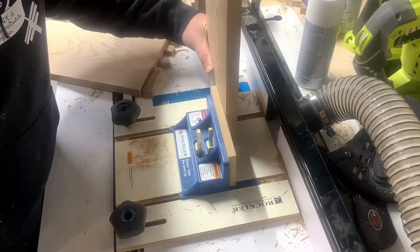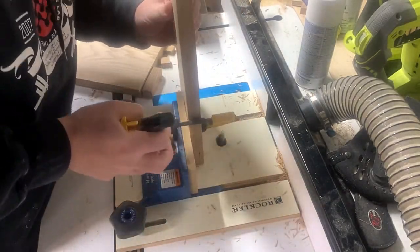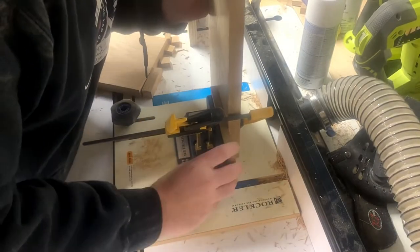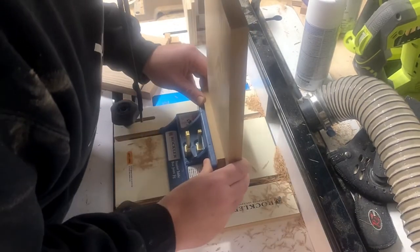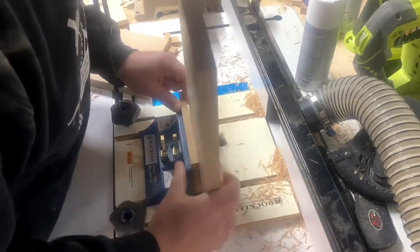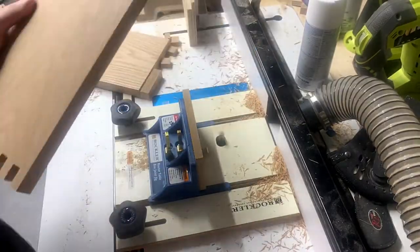While you watch me make cuts for the actual piece, here's a very important tip: it's better to have the router a bit too high than too low. You can always cut or sand off the fingers after you glue up, but if they're too short you'll probably have to start over. The router footage is mostly boring so I won't show it all — just make sure you pre-plan your cuts so each side fits into the other side correctly.